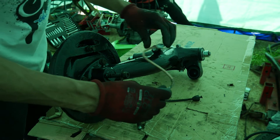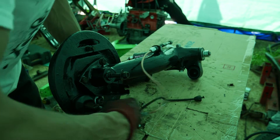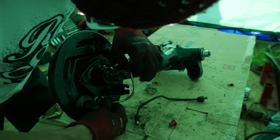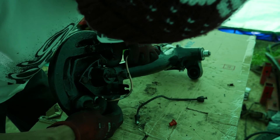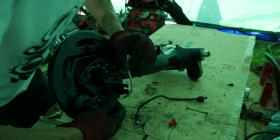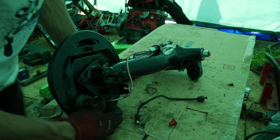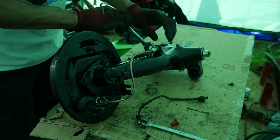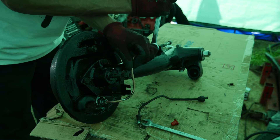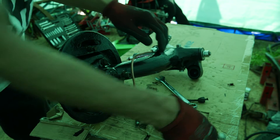As you're putting it on, remember you're still going to have to make small fettling adjustments, so leave the unions just a few turns on, then adjust where necessary by hand. Give that a good nip up — now I'm happy with it. This side is an 11mm — it shouldn't take too much to tighten them up, but you should be able to feel in your hand where it feels good.